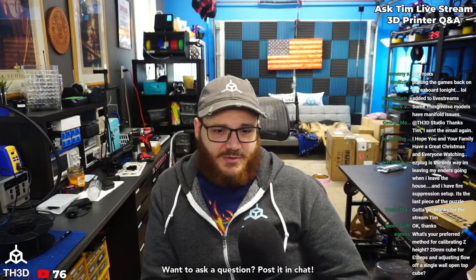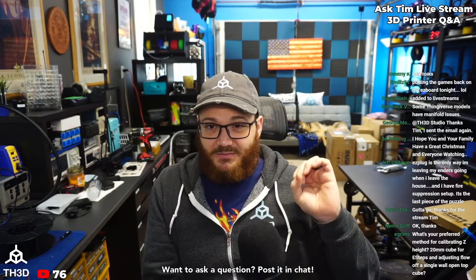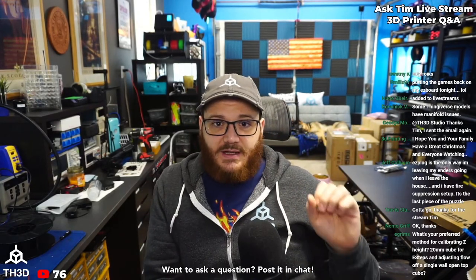Jeff Cullen says, Easy Plug is the only way I'm going to leave my Enders going when I leave the house. I have a fire suppression set up. It's the last piece of the puzzle. Yeah, so the Easy Plug will be nice because of the plug-in for Tasmota with Octoprint. Octoprint on a Pi with the Easy Plug together will allow, even if the printer's firmware completely screws up and the printer's hard locked, the plug-in to shut the AC power to the printer off. So let's say worst case scenario, there's a dead short or something and it's just smoking. It can actually cut the power going to the printer's power supply and kill it.